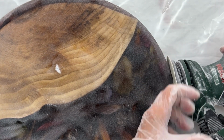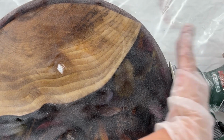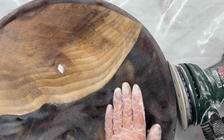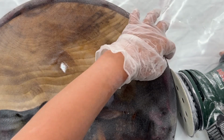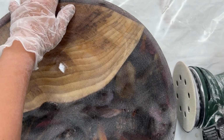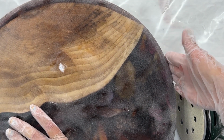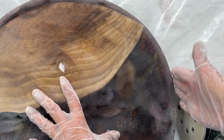Firstly, the vibrating machine's design allows it to move in not only a circular motion, but also vibrate a bit. It vibrates, and if you use it flat, the machine and your hand will have a shaking motion that could tire you out. However, if you angle it like this, applying a bit of pressure with the nozzle, it provides a better grip, and the disc operates more directly and removes the debris more efficiently. The whole edge is leveled.